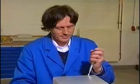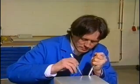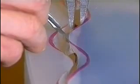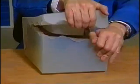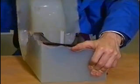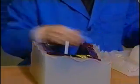After cutting all around the mold in this wavy movement, the pliers are used to hold the two halves apart, and the last connections between the two halves are cut with a scalpel so that the mold can be opened completely. After the mold has been opened, the master model taken out, and the tape removed, the mold is ready for a first cast.